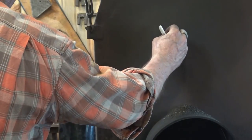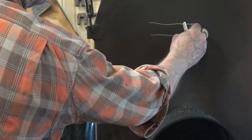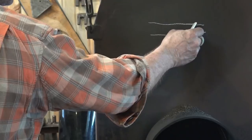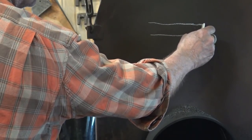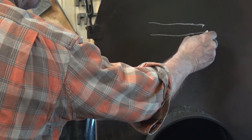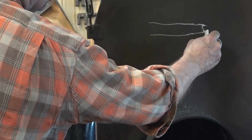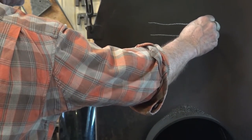When you draw a bar out, you start with a parallel bar, and you start to taper these ends, you're actually affecting the surface more than you are the middle. This tends to upset, and that's what causes the mushrooming on your chisels. But that means you end up with what some people refer to as fish lips as you draw this out. The further you draw it out, the worse those fish lips get. Ultimately, that forms a cold shut, and you need to get rid of that.